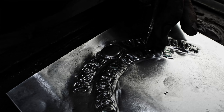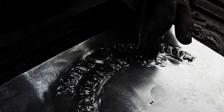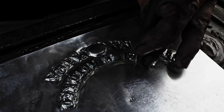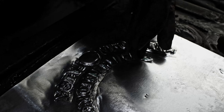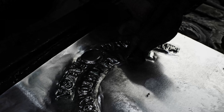Here I am doing a repousse technique — embossing and raising up letters in pure zinc sheet. This is for the crankcase. I did all the sculpting of those sorts of pieces. Other things like the oil pump were also done by myself using techniques like this.